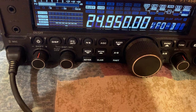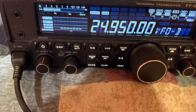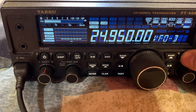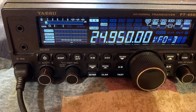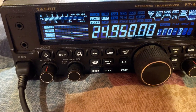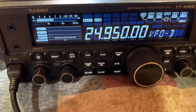On 12 meters, checking the SWR — it's not too optimal. I might need to take out some kinks in my antenna. If I put the tuner on, that's pretty good. Look how nice that is tuning. If you adjust the settings you can tune it down to basically zero, but the best thing is to get your antenna working better. It has a really nice antenna tuner in this radio.